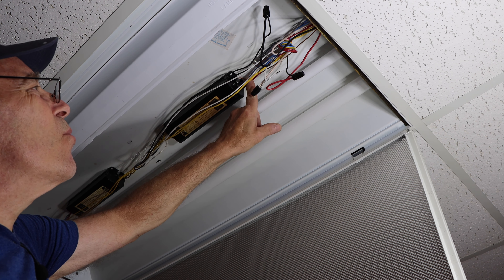That's it, it's all set! The only thing I will tell you is to be very careful which ballast you get. If you get the wrong one you're going to be short wires or not have the correct amount or color of wires. If you have a four-light fixture, make sure you get a ballast for a four-light fixture. That's it, this job is done. As always, thanks for watching — I'll see you on the next one.